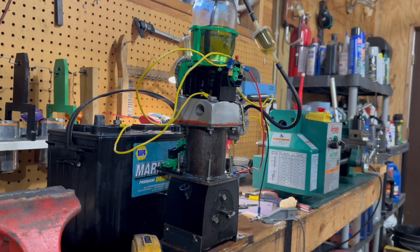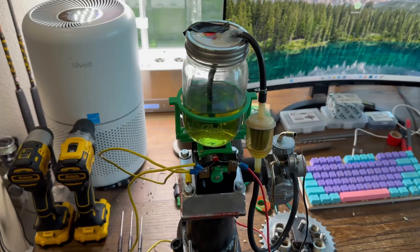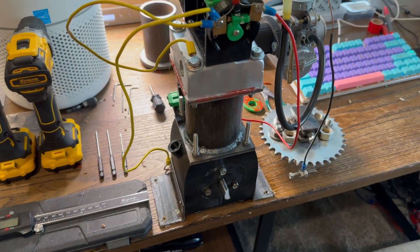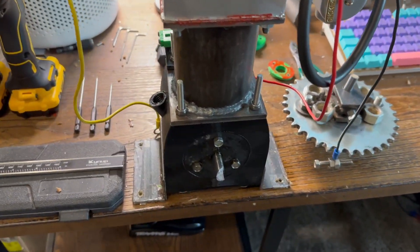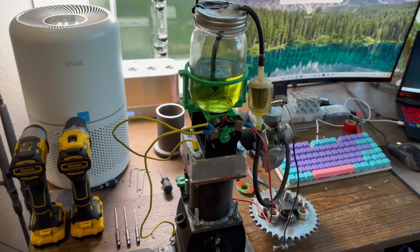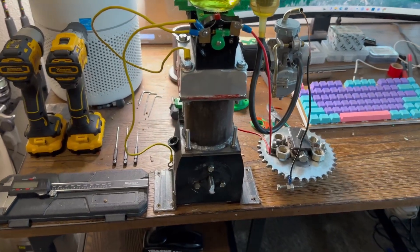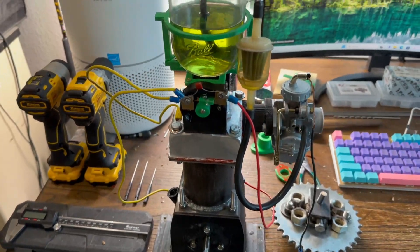The engine was actually running, but there goes the crankshaft — trial and error, that's what this is. I'm going to have to remake the crankshaft. I'm thinking 19-millimeter thick steel rod, which is basically double what I had — about three-quarter inch. I want to try to keep the same bearing so I don't have to re-3D-print the crankcase, but everything else on this engine seems really good except for the crankshaft.